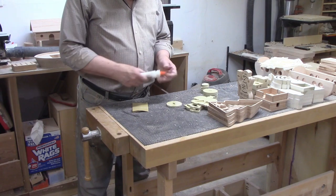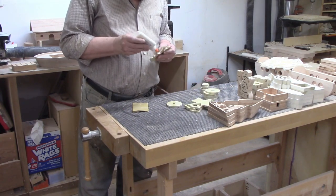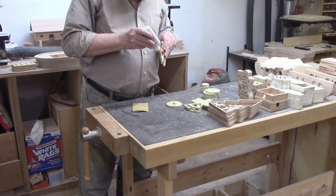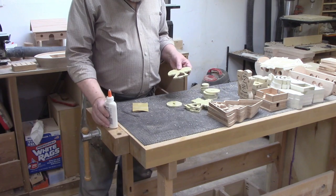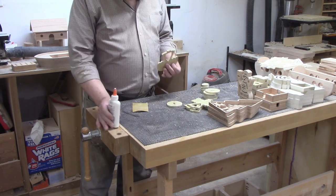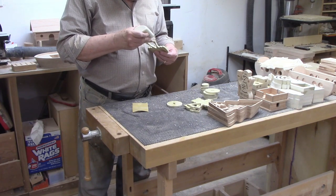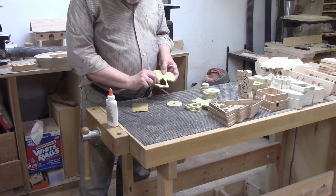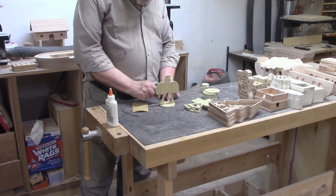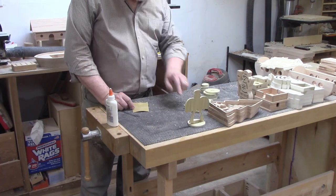The glue up for the angels is very easy. I used a glue bottle with a small tip to apply a bead of glue to the surfaces that would be touching the base, then slipped the tab into the slot. I set this aside for the glue to dry and then came back to glue the small circle to the bottom of the larger circle — its purpose is to lift the base up off whatever surface the angel is sitting on, to make the angel look like it's floating in the air. After the glue dried I took these to my paint booth and sprayed them white. I thought about painting the base a different color but couldn't think of a combination I liked, so I decided to stick with white for the whole display.